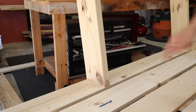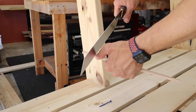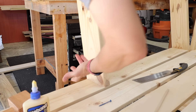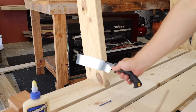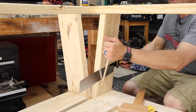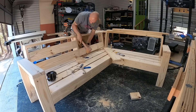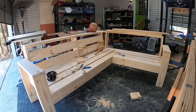For the pocket holes that are facing down, you want to fill those — I like to use a three eighths inch dowel. You can buy pocket hole plugs if you don't want to cut these, but I usually cut about a two inch piece off, put glue on there, and that's going to prevent water from getting down in there and just standing. Drive those in there until you hear it bottom out, then let that glue dry for 30 to 45 minutes. Then I'll take a flush trim saw, cut it off smooth, and sand everything so it's plugged. Now it's time to put the back supports on to support those cushions — these are just pocket holed in from the back. I used a scrap piece of two by to space them out from the bottom of the bench and between the two boards themselves. Then we come back and fill those pocket holes with the same dowel method.